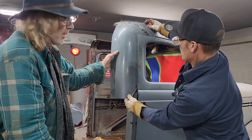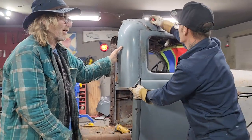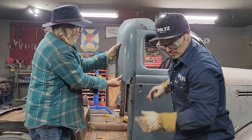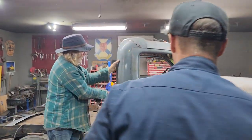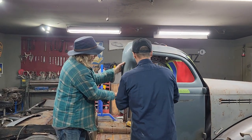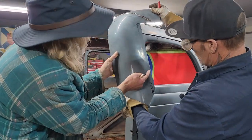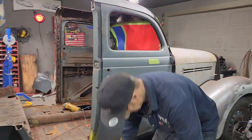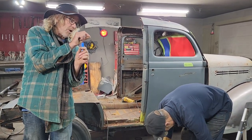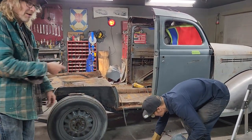Yeah, I think it's. That's good there, don't it? It must be fairly straight. You hold that right there, Jim, with two hands. Yeah, it looks good. Follow the right line. I used to put little X's on the wrong line. That way you know not to follow. When you make your right line, at the same time, just take your marker and put a little X across the line that you don't want to use. There we go. So that you don't get screwed up down here when you're trying to step the grinder.